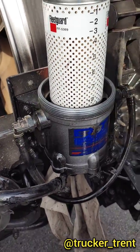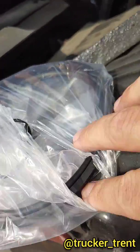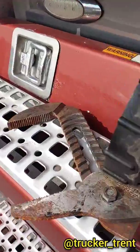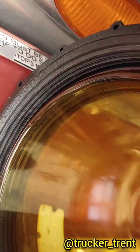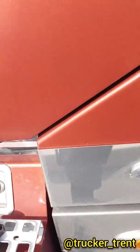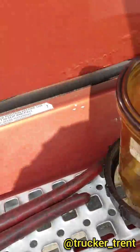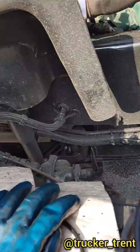And then we'll switch the O-rings out real quick. You'll notice you've got a square one and a round one right here, depending on what O-ring goes in your housing. So you knock this ring off here. O-ring's going to be inside there. You can see it right there. Switch it out. A little O-ring goes around this cap. Put it back together, fill it with fuel. Alright, new O-rings put on. Installation, we'll just pop it all back together. Let's do this with one hand. Usually can.